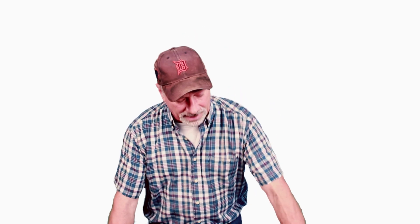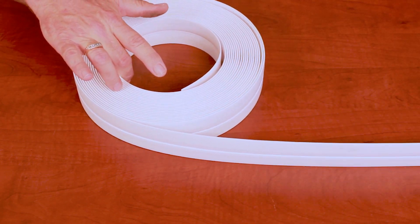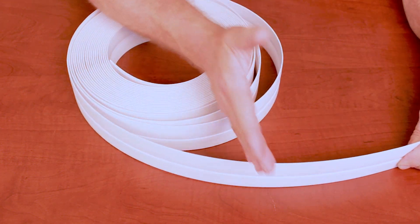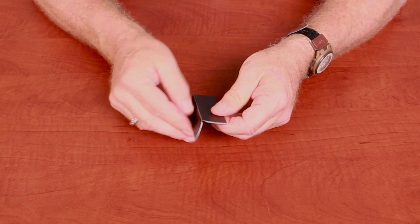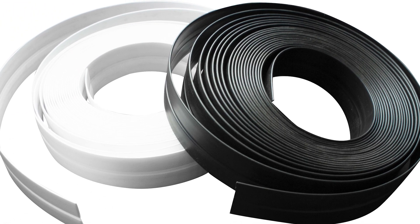What would be the advantage of this? Well, plastic doesn't corrode, plastic will bear many cycles, plastic doesn't squeak, and plastic is easily attached. And because it is typically extruded in a large roll, we can process this just like we would a metal hinge — feed it out of the machine in any length you might want, cut the outside edges in any shape you might want, and put in a hole pattern for attaching it to whatever you're hinging. Living hinge is really suited for lightweight, rapid, multiple-cycle opening and closing hinges that do not suffer a lot of side force.